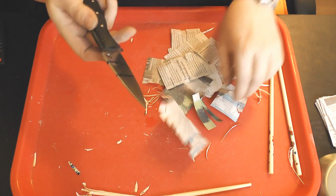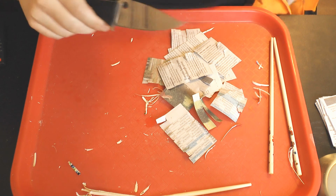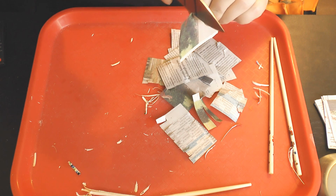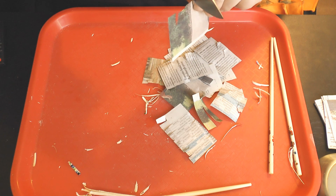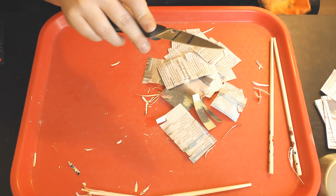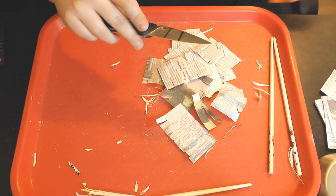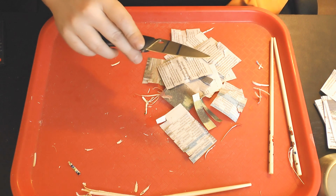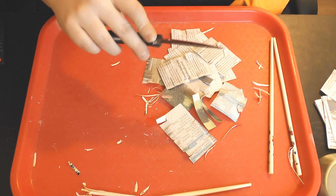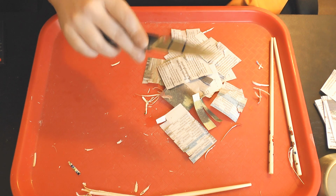So I think at this point we can say that there is a noticeable loss of initial push cutting sharpness, and I'm going to take some microscope images of this apex, or rather the edge bevel, because I don't have enough magnification to really see the apex directly. That would require an electron microscope, and I'm not that crazy just yet. But I am going to take some USB microscope images to see if there's any visible microchips in this, and I will cut them into the video at this point if there are any.